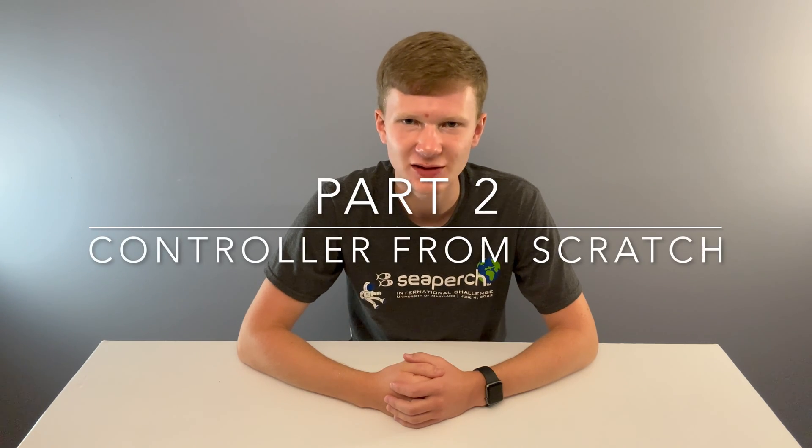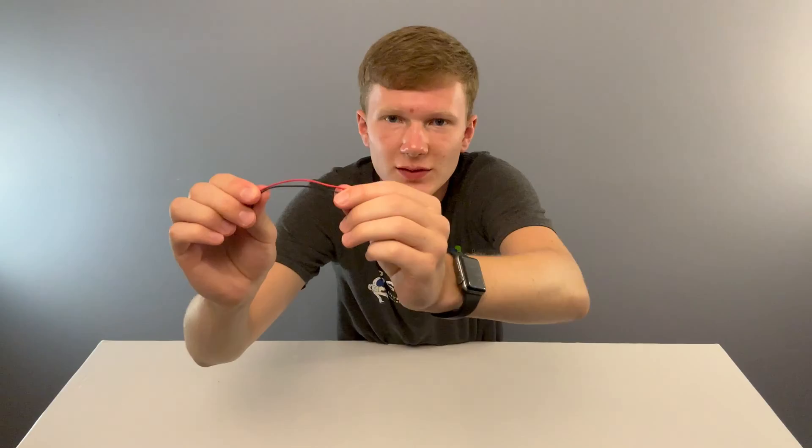Alright, time to assemble the controller from scratch. It's a bit less straightforward than making the controller that came with the build box, but I prefer doing it this way as you can see how the electricity travels and makes a circuit. You will need tools to solder, masking tape, a sharpie, a little plastic box with a lid and holes for screws on the back to use as your controller case, a drill and a quarter inch drill bit, optionally a vise, two dual momentary or toggle switches, two single momentary or push button switches, about a foot of Cat5 wire cut from the rest, about five to six feet of 18 gauge 2-core wire, two feet each of red and black 22 gauge wire, electrical tape, one of these kinds of fuse holders, a fuse, two alligator clips and the red and black insulators, and sandpaper.